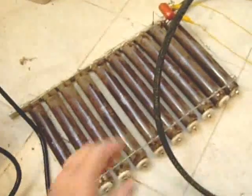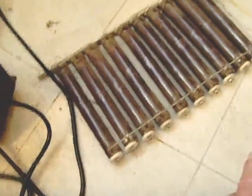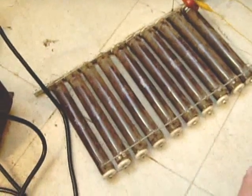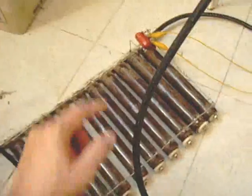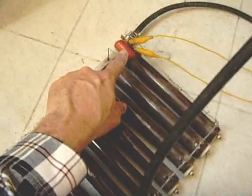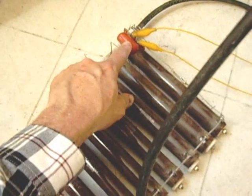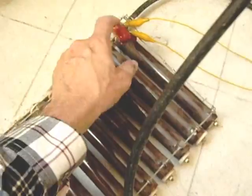Here is the dummy load — it's an old dummy load, probably worth about 1,500 watts worth of power. Its resistance is about 53 ohms. I have an RF peak detector here which simply rectifies the RF with a couple of high voltage diodes and a capacitor. I run that over to the meter and that way I can measure the power very accurately.